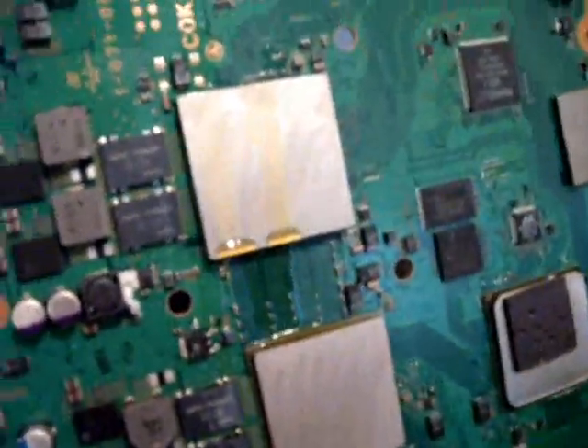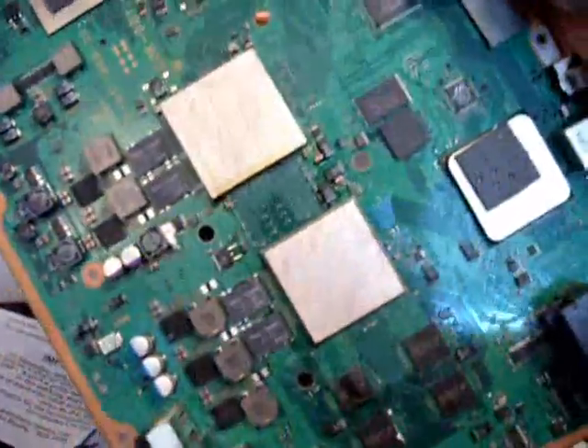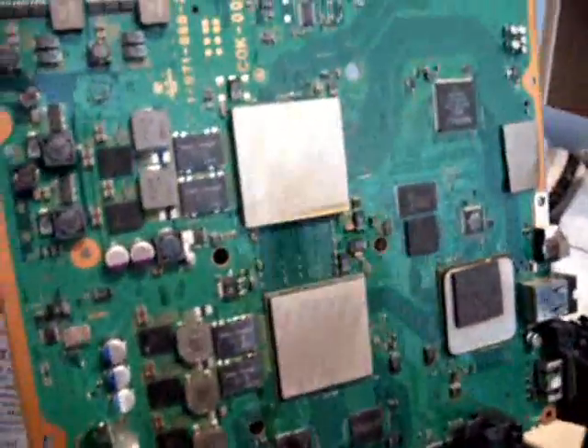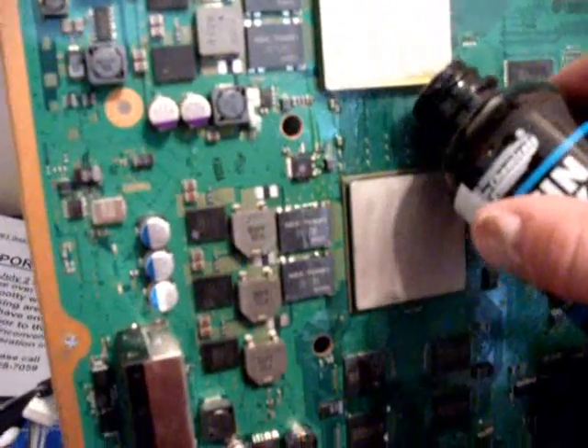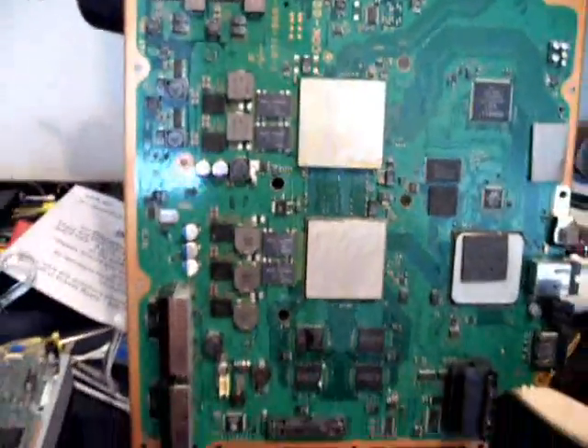Alright, here we go — you're going to use a pretty liberal amount. I just pour onto the edge of the board. You see I got it on the top of the chip there — you want to avoid doing that if you can, it's a real pain to clean off. You can see it's just leaking underneath the chips and flowing downwards nicely. What I like to do is tilt the board a little bit while doing this — that just helps flow it under the whole thing. It'll take a couple of good liberal dowsings before you get it all the way under the board. Just add a little more to the second chip and it's flowing underneath quite nicely now. You can see it just started pouring out here and over here.